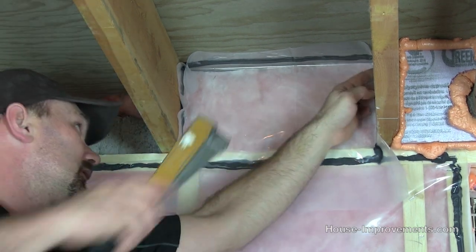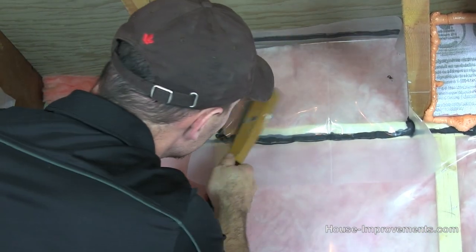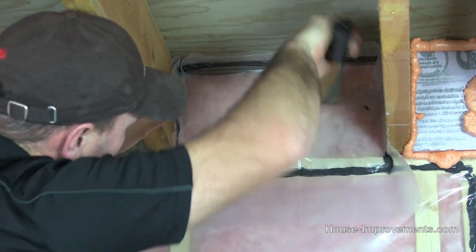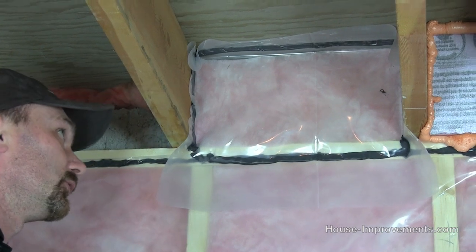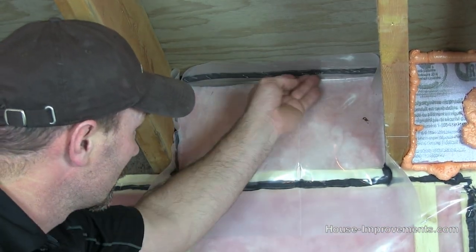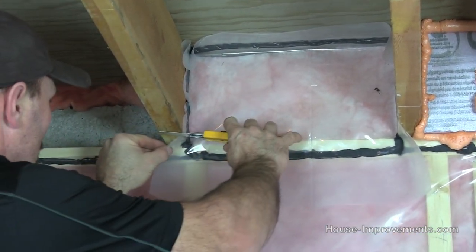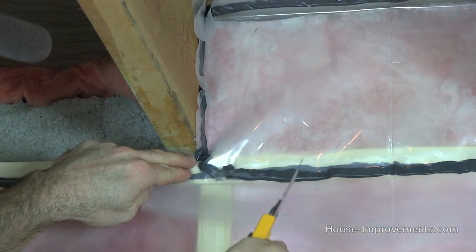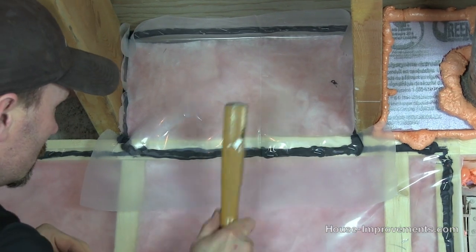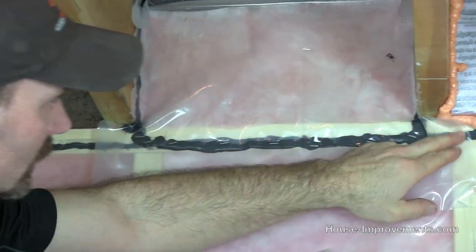Just like that — we'll get a few staples in it before it moves on us. Try to staple right through the poly and right into the acoustical. You'll find that you need a few more staples than when you're normally just doing vapor barrier, just because of the tight quarters. Get enough in there so that it isn't going to drop down and come free of the bead. Now you can kind of see how the two edges come out here — just make a little cut back so that'll fold out of the way when you do your drywall. Get some staples in here just like so — staple that flap down out of the way.